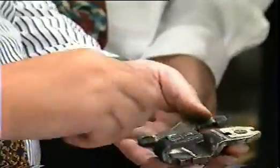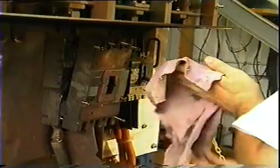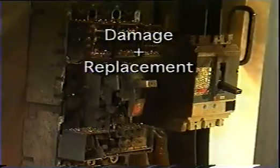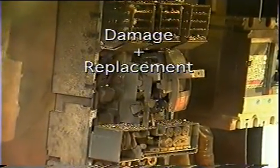Certainly, if we were able to put that breaker back into service, we would have a higher heat rise problem in the switchgear. Although MCCBs are designed for quick and easy resetting, damage sustained during fault interruption means in many cases they need to be replaced. In conjunction with damage sustained by associated equipment, this can entail considerable downtime and expense.